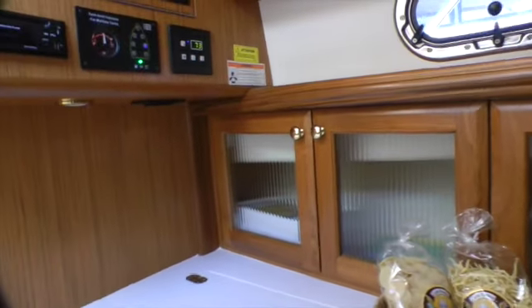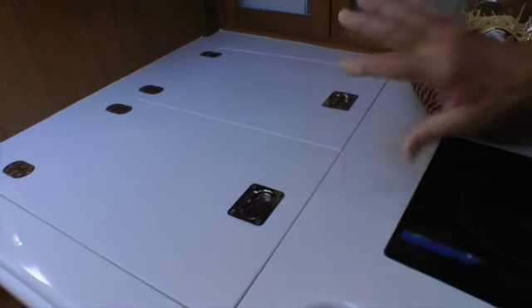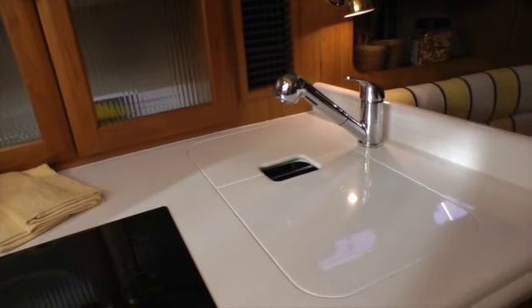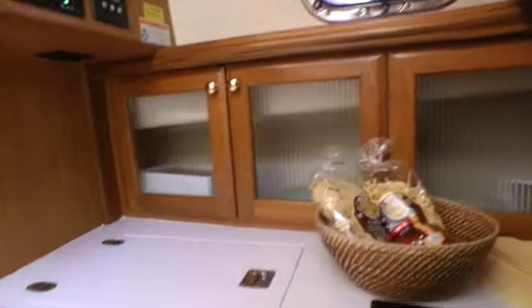All throughout the boat these features began to pop up — good appliances, good refrigeration. Here, for example, is a drop-in freezer or drop-in refrigerator, both of which have dual-range thermostats and are able to either freeze or serve as refrigeration. They mimic the holding plate style of refrigeration that was very popular years ago, but those were somewhat troublesome and some mechanics were not able to service them adequately. These are hermetically sealed, built in a factory where no contaminants exist, and they drop into place as top loaders — the most efficient configuration. Around them there's probably about four and a half inches of insulation, surrounding a box which itself has two inches of insulation, so they have very long staying power.